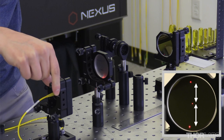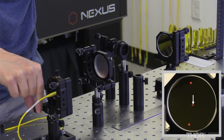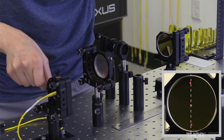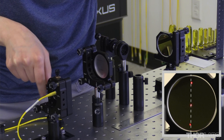The pitch adjuster changes the relative distance between the top and bottom spots compared to the middle spot. When the three points are equidistant, the input beam will be traveling parallel to the table. The yaw adjuster translates the middle spot left and right. When the input beam is horizontally aligned with the screw holes in the table, we have a line of three equidistant spots on the mirror. Translating the horizontal position of the input beam will rotate the line slightly about the center of the mirrors. Translating the beam in the vertical direction changes the length of the line.